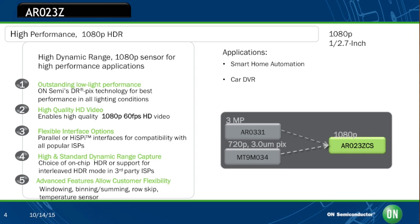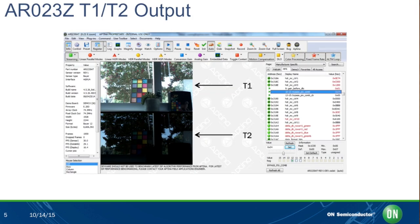That dynamic range is really impressive, and HDR is really important in a lot of applications where we need to see both shadow detail and bright areas. So how do you get the high dynamic range on the MatrixCam? For high dynamic range processing, it supports both on-chip processing and also off-chip HDR. By default, the sensor powers up in HDR mode. The HDR scheme used is multi-exposure HDR, which allows the sensor to handle up to 105 dB dynamic range.